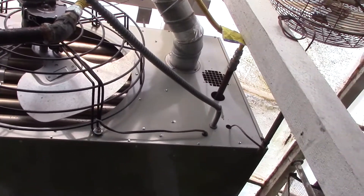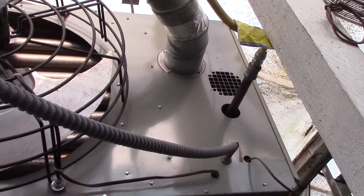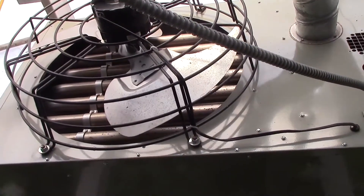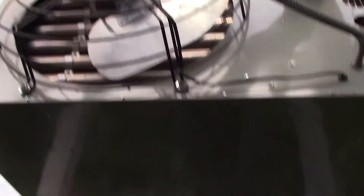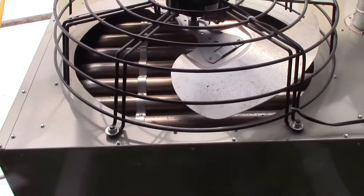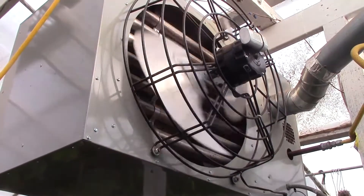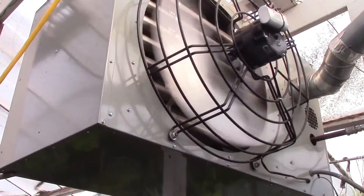Let's turn on the heater. That's the exhaust fan turning on — the little one. There's the sparking, and you can hear the gas — that whistling sound is the gas going through the pipes. So it's heating up the coils of the heat exchanger, and then once those heat up sufficiently, the blower will come on with the hot pipes. There it goes. Thomas, you'll be nice and warm in a few minutes.